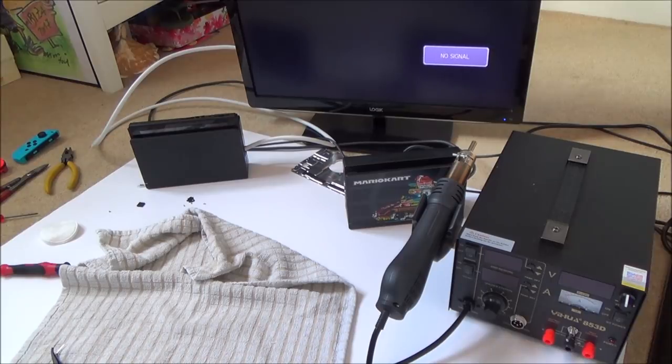So unfortunately, I think this video is going to be left up in the air again. Hopefully the suggestions that you guys give me will make me go forward and be able to get this switch docked eventually. You know, I tried different docks. I tried the HDCP thing. I tried doing all the different resolutions. I tried heating it up, you know, whether I did a proper reflow there, no, I don't think it was hot enough to actually reflow all the solder, but I did apply a fair bit of heat for a while and it didn't make any difference.